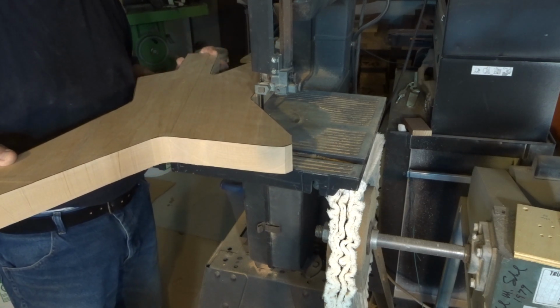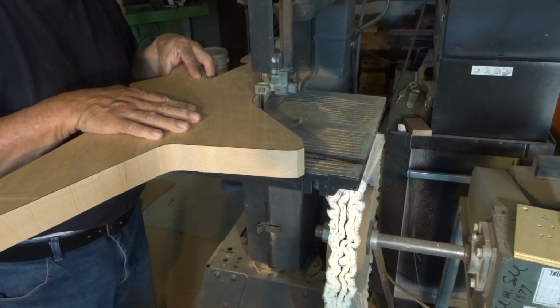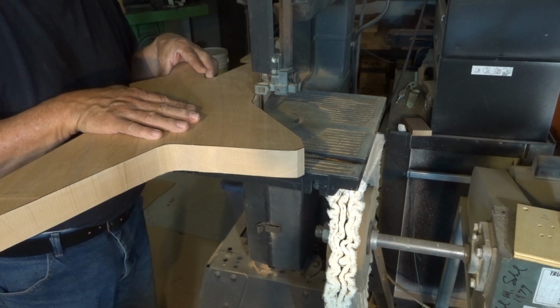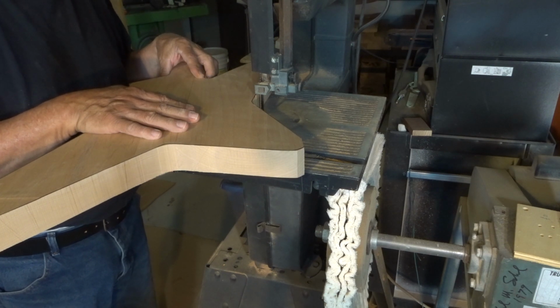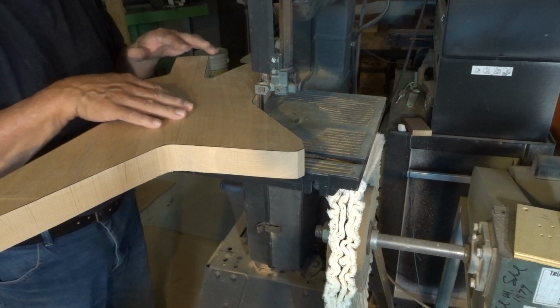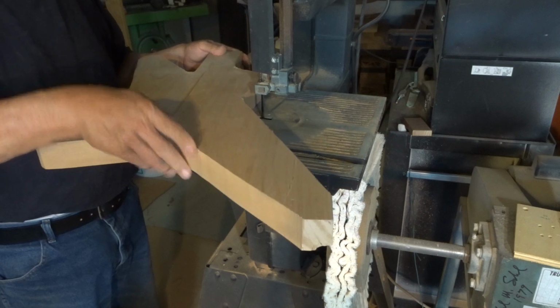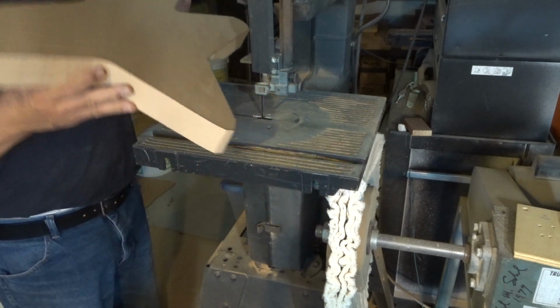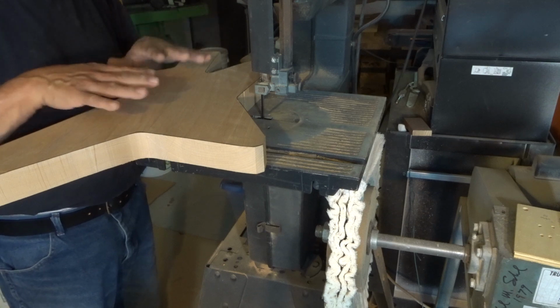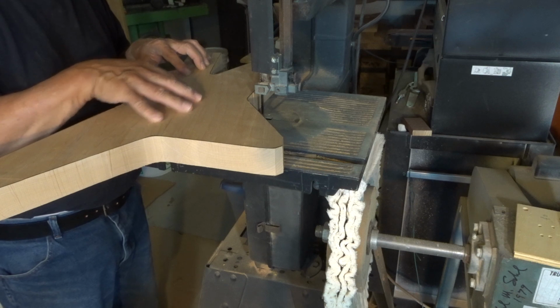So there we go. That is the blank cut out of the Star guitar. It's a very rough cut. And I think in the next video, which would be video number 6, we'll be doing the neck pocket route along with a single humbucker and a tremolo. I will be using a vintage style tremolo system, so we'll need a tremolo cavity and also our control cavity. But I think we'll just focus on some of the top routes first.